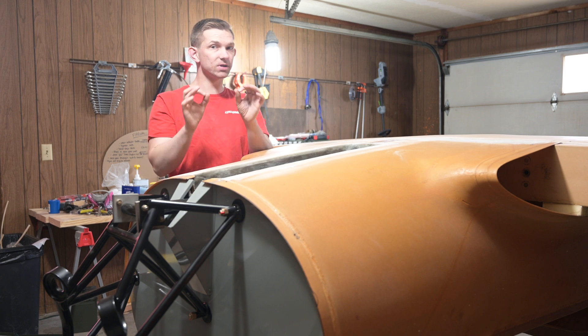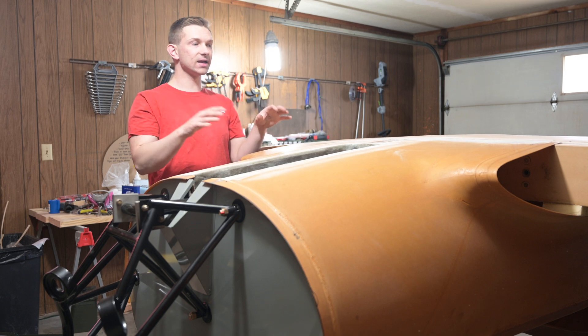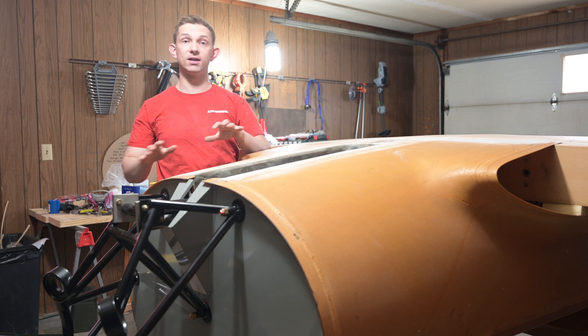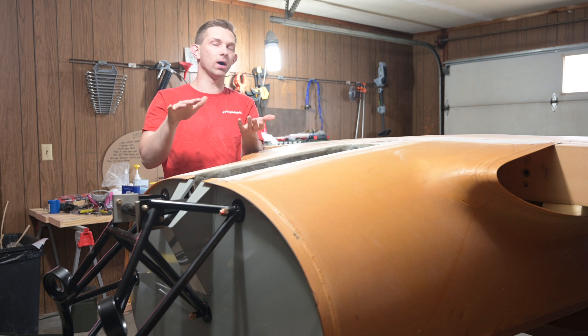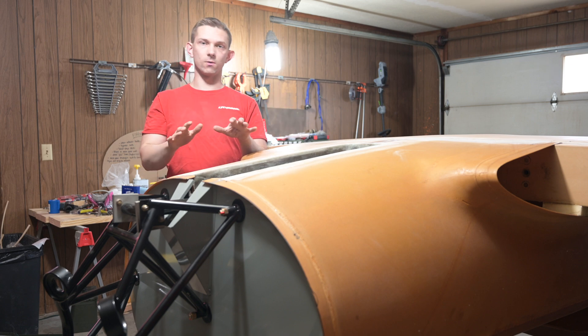You do want a little bit of preload on those doors just so they sit nice and tight. I can flip this plane over — the top wing rib is not on yet — so I can do a bunch of gear swing tests once this is all set up and set that tension exactly where I want it. I still think this is the right approach.